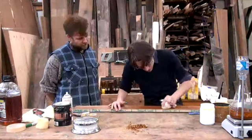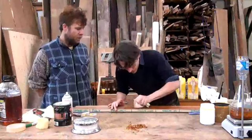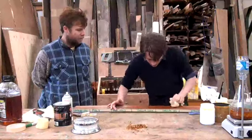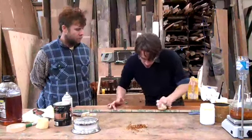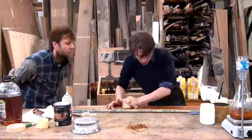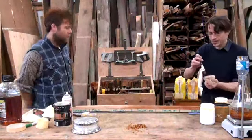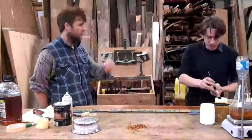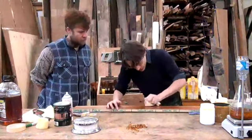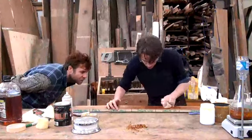One thing when I've done this, I stress about how often I have to keep applying the shellac back onto the pad. Like if you feel that it's gripping, because you can pull the old stuff back off. Yeah, that is the danger with this sort of thing, because you're using the same thing that dissolves the shellac, and you're putting so much work into it, you can pull the old stuff off. And when do you want to rest on this? When I feel like it. So you think that's evaporated enough, and then you just keep going? Yeah, with this process, because you only put so much on, it usually evaporates pretty quickly, and I can almost keep working the surface. So you can already see the shine difference compared to the brushed one.